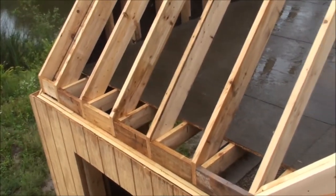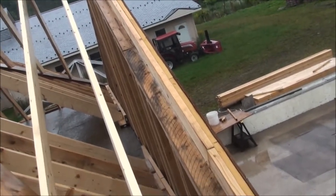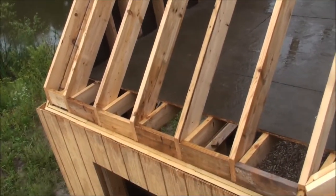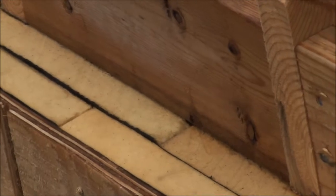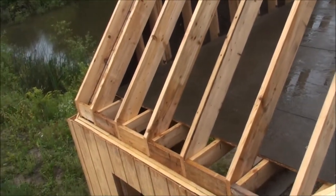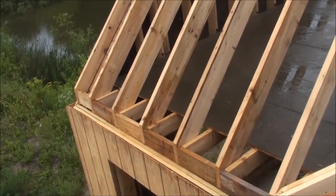Because I'm working by myself I can put some of these sections of insulation on from the inside, working within here instead of going up and down ladders over and over again — that really does wear you out. The insulation, when it's put on, the seams don't come into alignment so you can't really put a double layer here and then work your way up and put another double layer there and adequately make certain that the seams aren't aligning. So that's what I'll be doing over the next couple of weeks — getting the insulation on and battening it down with the two by fours.